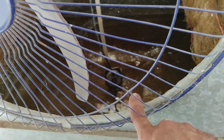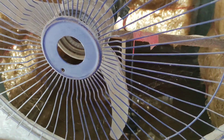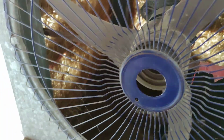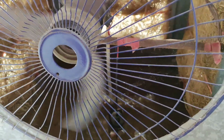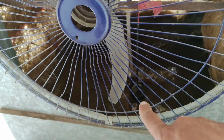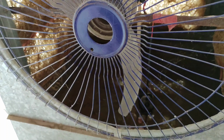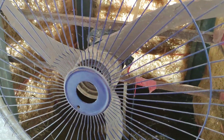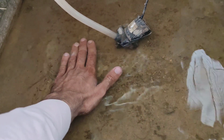It consumes a lot of water. If I just start it in the morning and it runs till sunset, approximately 10 hours easily, then I need about 25 to 30 liters of water per day. That's a lot of water. So when I just want air, I shut off this submersible pump, and this saves water, because 30 liters per day is a lot of water, and all of that water is going into the air through evaporation, which is really unique. So the water in here is very cold.